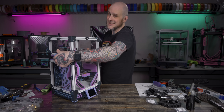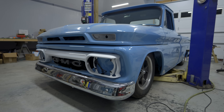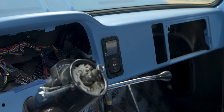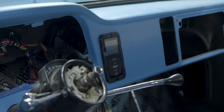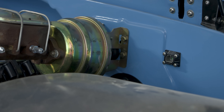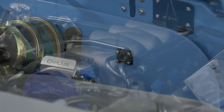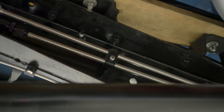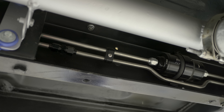Sometimes you're going to run into problems. There are a fair number of components on this truck that are 3D printed — not just the gauge cluster. There's an air ride control system mounted in the dashboard with a touchpad inset into a 3D printed component. There's also an air-water separator using a 3D printed clamp mount to the frame rail, a trim piece on the firewall for a Deutsch connector sending power to lights in the hood, and from front to back, stainless hard-line tubing custom bent for it with 3D printed clamps holding them neat and solidly to the frame rails.